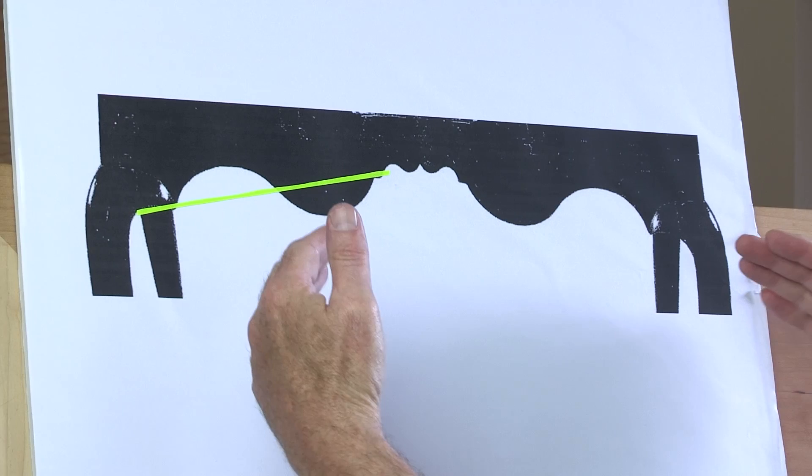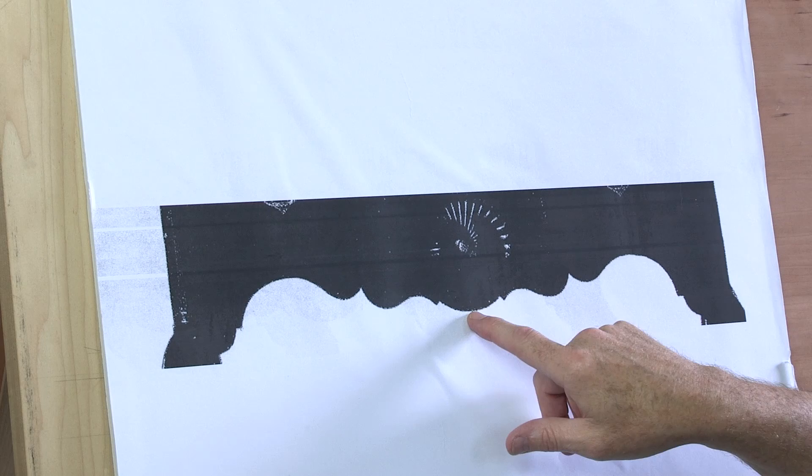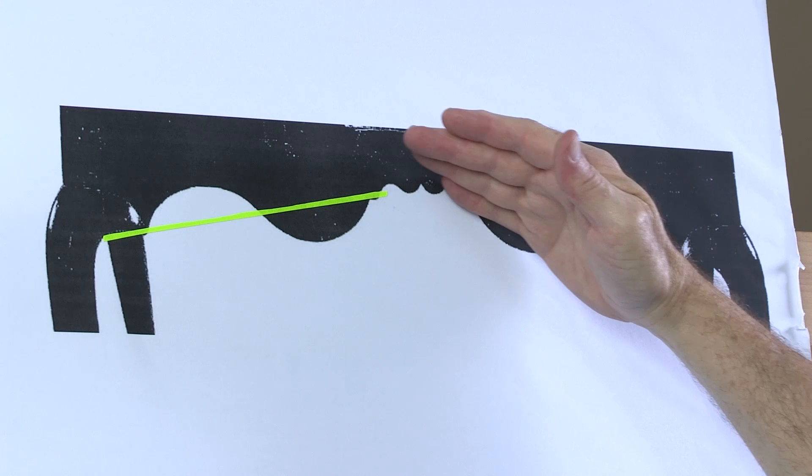When I look down at the one below, even without putting layout lines on there, this seems to be flowing downwards towards the bottom of this arc — that's another difference. If I put another layout line on this smaller cyma curve, I would find the same thing: it's a symmetrical cyma curve. The curves are identical on either side of the transition point, and that layout line would also point upward towards this apex.